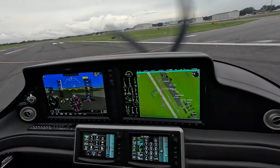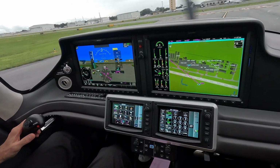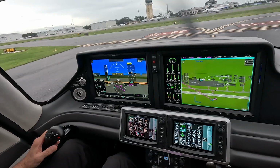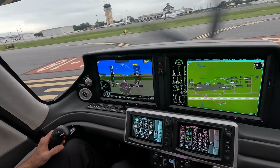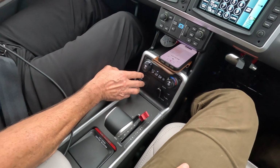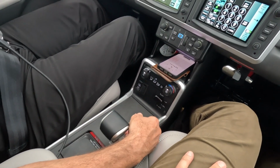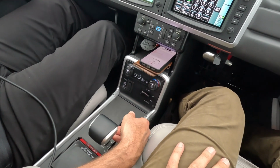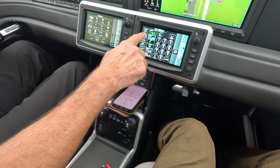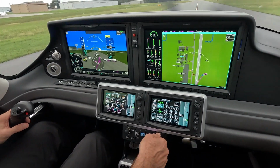And folks getting off runways, recommend don't turn off the runway at more than 10 knots of ground speed. It's a lot of side load on your tires. All right, as for clearing the runway, prepping for check rides, remember don't do your after landing flows until you're clear of the runway. So the after landing flow, all right, boost pump coming off, flaps coming up. I give the mixture just a couple seconds before I start leaning on a hot engine. And then last but not least, making sure that my transponder is reset to VFR.